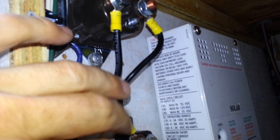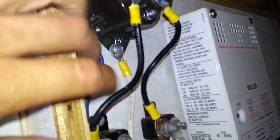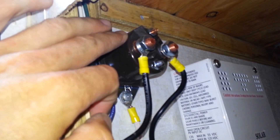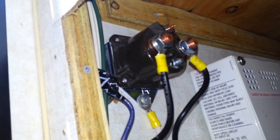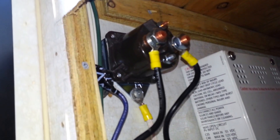The other thing I have going on here is I put this solenoid in to replace the existing one. That actually connects the battery from the truck to the coach batteries down here, to get a little charging off the alternator. When this ignition wire is powered through this terminal here, it's supposed to charge the coach batteries. What I found was the original solenoid wasn't opening up entirely whenever you shut the ignition off. So I replaced it with this one and found that it gets ridiculously hot and starts to stink. I would imagine it's not designed for continuous use. What I may do is find one that is, or keep it simple and just put a switch in — so if I want to run the truck, which isn't very often, I just come back here and flip a switch. Maybe something with a red light would be a good idea.